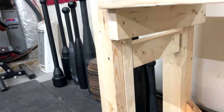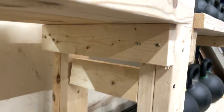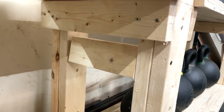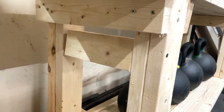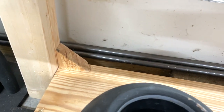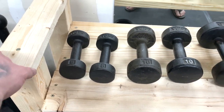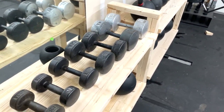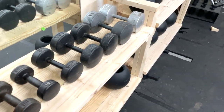I used two pieces of nine inches for extra reinforcement — you might want ten inches because I think I mismeasured my spacing — but ten inches would have been fine. I still got a screw in there for stability. If you have any scrap wood, cutting an angle and adding that makes it sturdier side to side, though fully loaded it doesn't move much anyway.